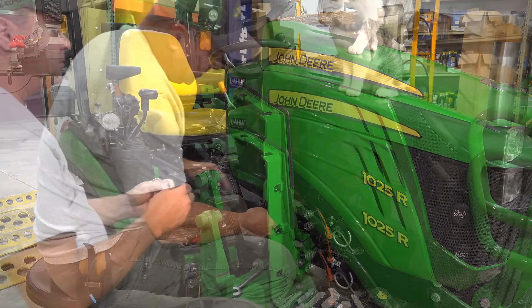When you're working wrench to wrench like this, the way you can get the most strength when tightening is to put the wrenches almost together and then squeeze your hands together — that's how you get the most strength. It might seem a little unorthodox, but when the wrenches are really close you can squeeze your hands like that and get a lot of force.